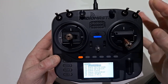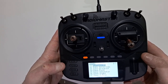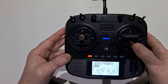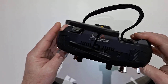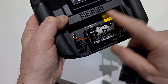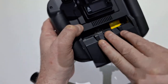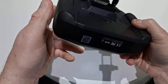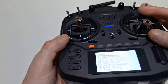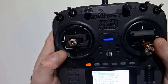I always have to take it in bits to swap it because I apply Mode 1. It really is fantastic and it also comes with Edge TX rather than OpenTX — back in the day I did change from OpenTX. As you can see on the back it has a holder; you can fit a nice 2S battery in here. I'm just running this because it's what I had in the Jumper, but you can have a nice 2S transmitter battery which will give you a good bit of charge. It charges off USB-C. The sticks that came on it were pretty poor — just a single-piece one. These are FrSky sticks I had from a long time ago; I think I had these on my limited edition Taranis and took them off.